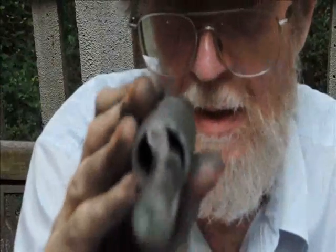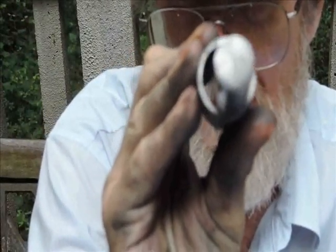Okay, this is what the cam looks like. I was originally going to weld it, but I realized that with it ground in like this, I could simply precision file a shim and just put that in so it makes this replaceable. Also, you can try different throws.